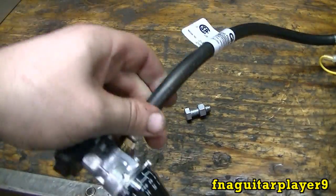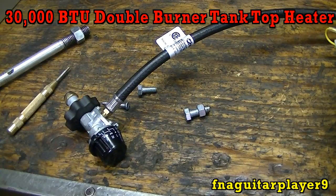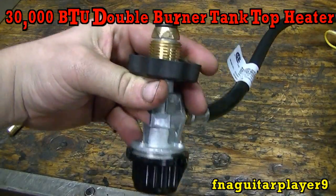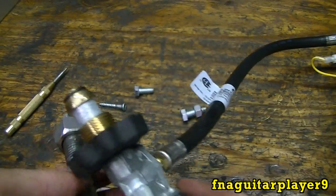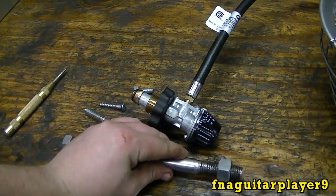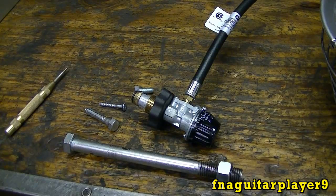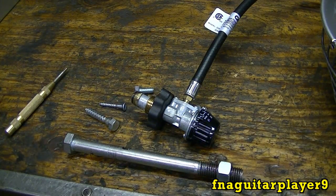That's the only gas fitting I could find that was left-hand. If you want to see that heater in action, I'll put the link right here — you can click it and it'll open in another window. But that's how you identify left-hand and right-hand threads. The only time you really have to identify this is if you've bought something that's hard to take apart, or you're not sure if something is left-hand or right-hand — you need to check before you try to take it off the wrong way.